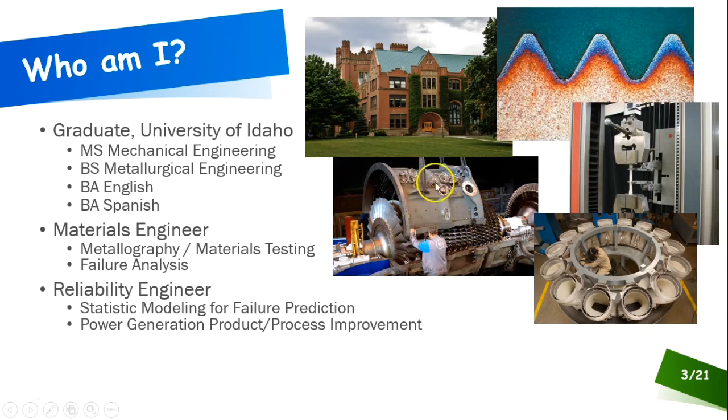And they want this heavy cast iron casing on your unit because if one of these blades cracks loose, and that's very possible, these blades that are just rotating at high speed fly off and they become very dangerous and deadly weapons. They'll slice through a whole lot of stuff, including people. So in order to keep people safe, you want to keep this cast iron casing on your unit.